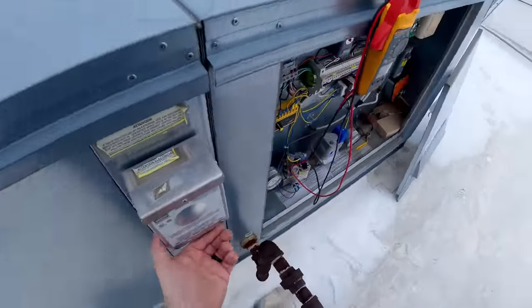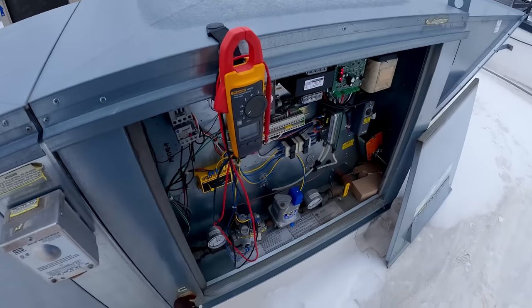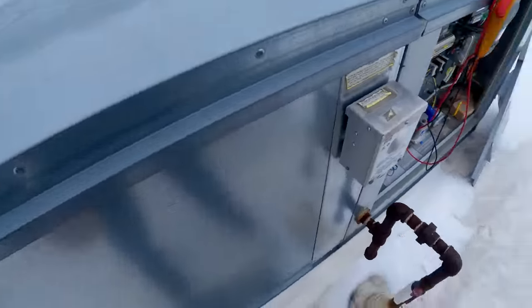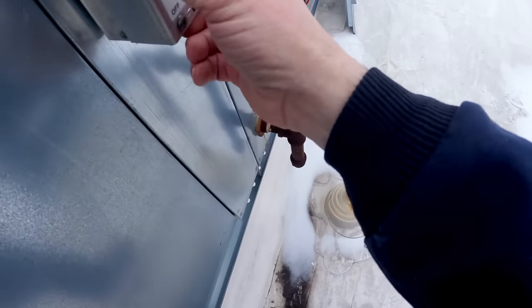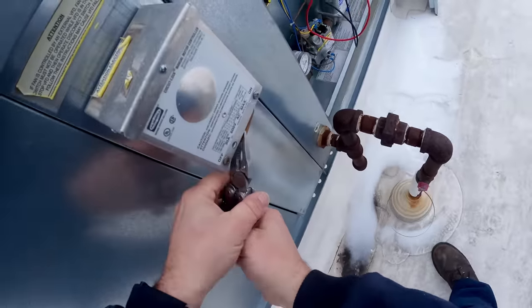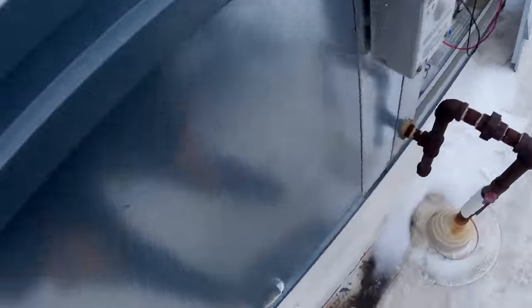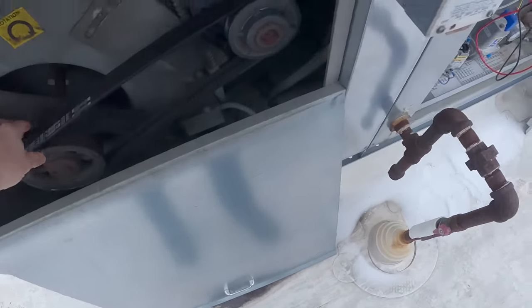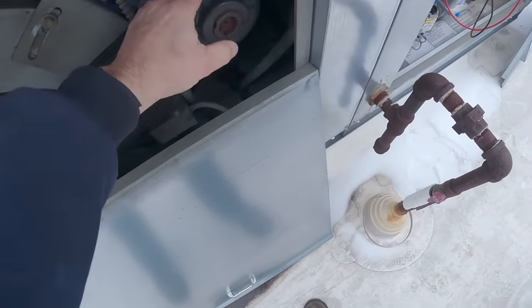We'll kill it this way — we'll turn the burners off. That will turn off just the main burner. That cold air is 19 degrees coming through here, so we'll drop that temperature in a heartbeat. We'll drop that off, now we can go ahead and shut them off. Man, my fingers can't feel anything. Slide this over — the belts are fresh, they look good.